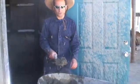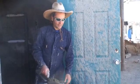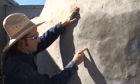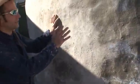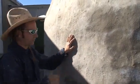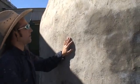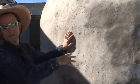We went on vacation and kind of let it dry up, so we've been adding quite a bit of prickly pear juice, and what that gives us is a really strong plaster. This has only been setting up for a few days and I can't even scratch it with my fingernail. We're not sure how watertight this is going to be, so we're going to cover it with a coat of prickly pear paint — grind up the paddles, add a little bit of lime, and use the thick prickly pear goo to make a paint sealant over what is already a paper, prickly pear, sand, and cement mix.